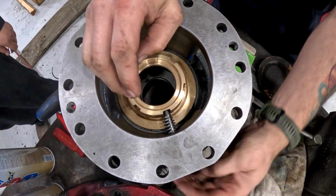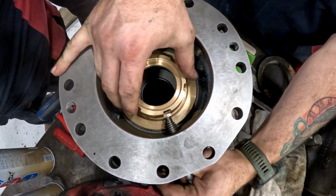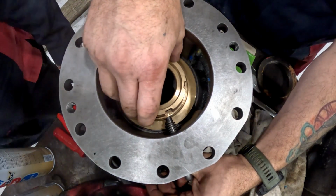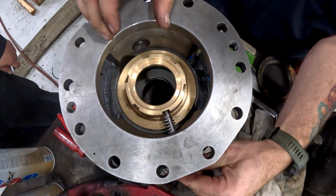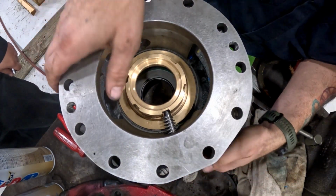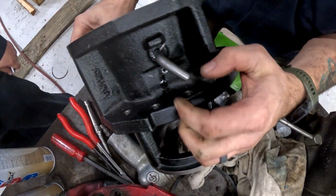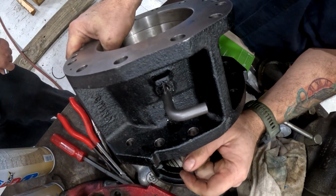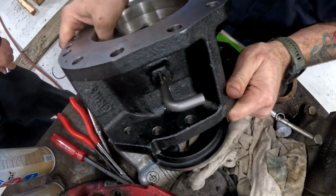This is perfect view right here, man. This is how a pump pack is. You pull this out. Then you can adjust it tighter. And then when you get it in the spot, set your pin, lock it. And this is what you're looking at. You pull this out, flip it over on the little step, and then you can adjust your pump packings.